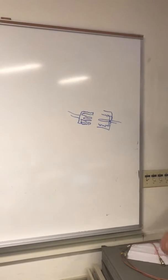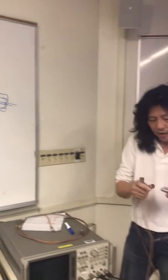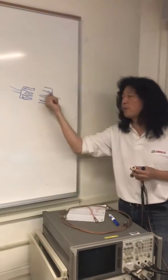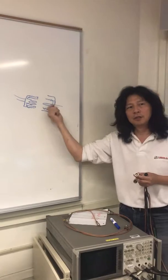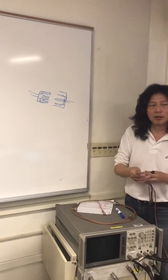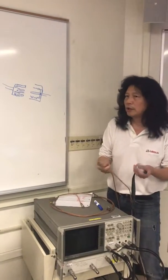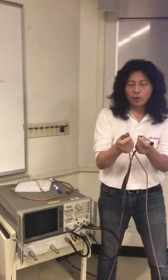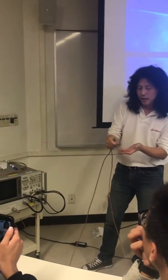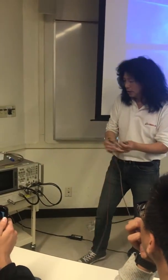Now what happens is, if you twist your devices, instead of the nuts, you are stripping this pin off constantly. So over time, this pin gets loose, and your measurements becomes garbage. Right? So have that habit of only turning the nut. One side, the nut is always free to rotate. Okay, so only do that.